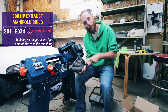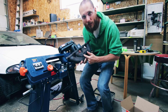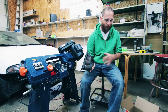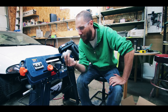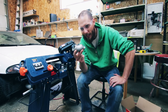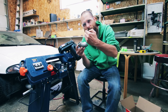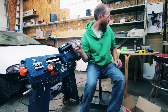I'm trying to push 33 PSI of boost through that motor, which is a lot of thermal stress on this manifold. Also the weight is really not helping things, so little cracks have started to form in the manifold. You don't want cracks in your manifold. So to get rid of this, I'm going to be building a manifold out of stainless steel elbows. The main roadblock is how do you cut these angles down the elbow so you can piece them all together in a Lego style build, and get the cuts perfectly square to the bend axis. In order to do that, you need to build a little jig for the saw.